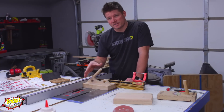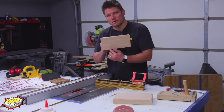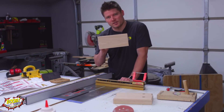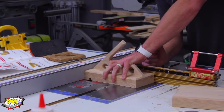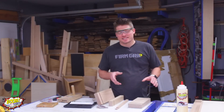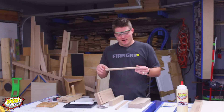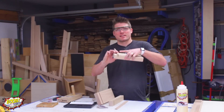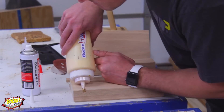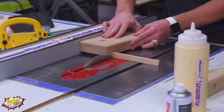The last thing to cut with the dado stack — which I've decreased in thickness to about three-eighths of an inch — is the dado on the bottom that will go transverse to the length of the board. This will house the catch that will clip onto the wood as I push it through. Then I cut some strips to fit those grooves. Once glued up flush on one side, I'll run them through the table saw to flush trim the other side.